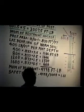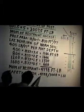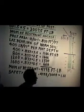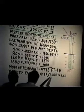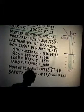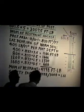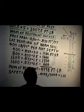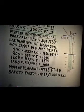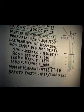Now we can calculate the safety factor. The safety factor will be our 4,998 foot-pounds of available restraint from the anchor divided by the actual moment of 3,008 foot-pounds, giving us a safety factor of 1.66 on that anchor. This is the way you can determine the safety factor and know how safe the thing is under that condition — and that's pretty important.